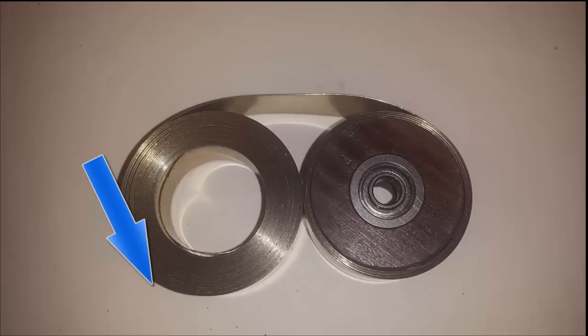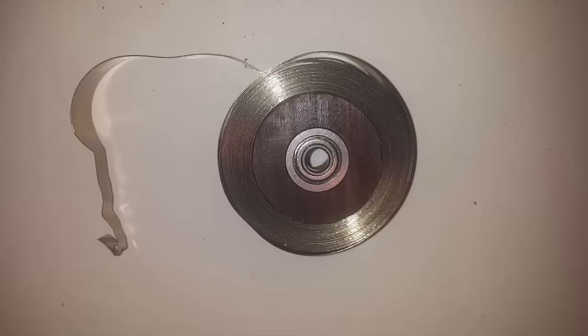To wind the spring onto the spool we just pull the end of the spring onto the wooden wheel — you don't need to attach it in any way, just holding it there. You then rotate the spring around that wheel repeatedly and when you're finished it will be fully wrapped onto the spool and the connection tang will be hanging off at the end. You have to be careful not to unwind one of these all the way. It specifies that you always want to leave two or three winds on the wooden reel, so you can either tell the user not to wind up too much or add some sort of mechanical stop to stop them from overwinding. When fully wound it'll look something like this — the messed up end is because my device has catastrophically unwound a few times and you often end up bending the last six inches or so of the spring. I've put a fold at the end of the spring where the tang is, and I'm going to fit that into a take-up reel.